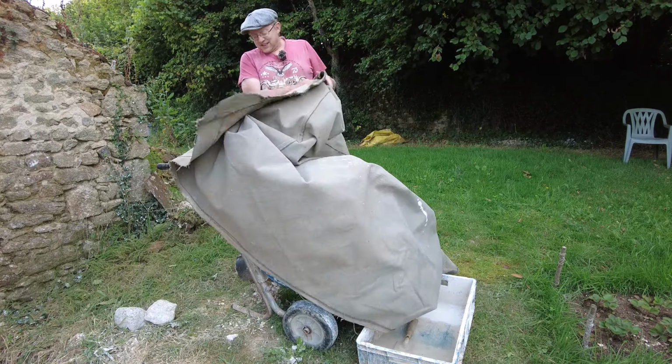It makes the lime mortar a lot easier to adhere to the wall. Although the aim was to rake out only to 1 centimetre or 2 centimetres deep, a lot of these stones had bees, lizards and everything like that nesting around them, and as you can see, some of them have got really deep holes around them. So this particular stone here would take, I don't know, 1 or 2 kilos to re-mortar back in, and a square metre of this wall would take quite a lot of material to re-mortar. And you can understand why a professional would charge anywhere up to €120 to re-mortar.